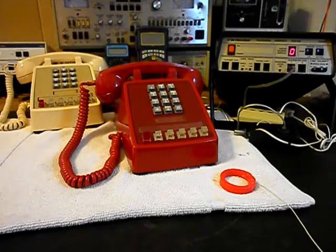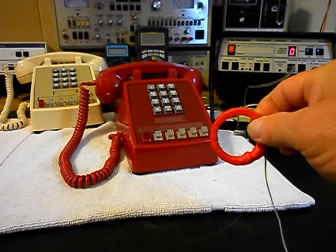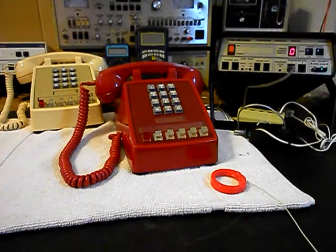Okay, we're back now and we are finished up with the repair and conversion of these cool 2565 desk telephones, and we're ready to start our final checkout. I also want to mention our amplified pickup. We use this in troubleshooting, repairing, and on our final checkouts. It's amplified so that you can hear the audio from a receiver, and since it's an open amplifier, it is prone to any static interference or noise in the atmosphere.